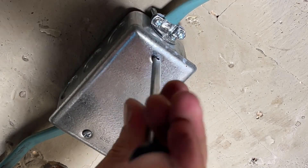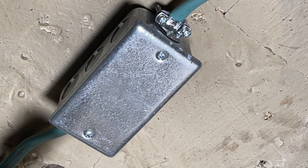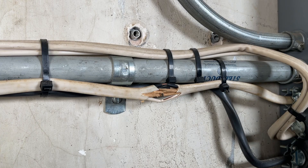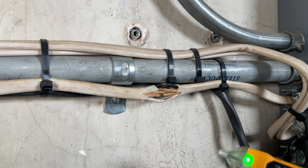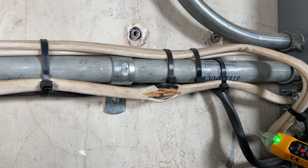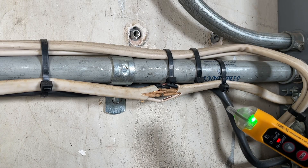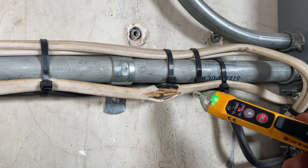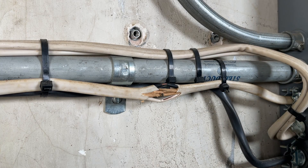This is basically the completed project to fix a damaged piece of Romex by isolating it into a handy box. Just like with the junction box, we confirm we have no power to the piece of Romex that we need to work on. It's always good to test on a known source first so you know your voltage tester works, and then confirm you have no power on the piece of Romex in question. So now we're safe to start the work.